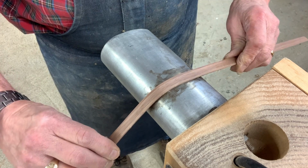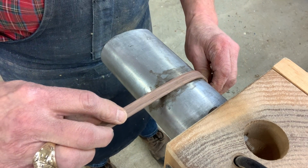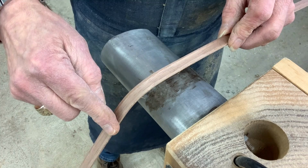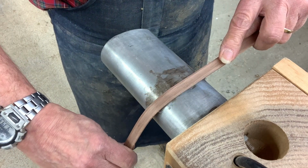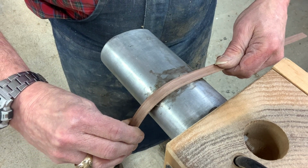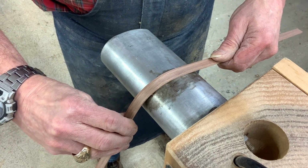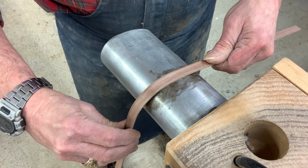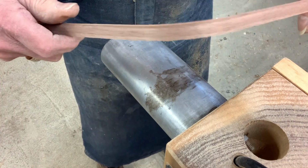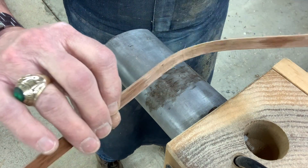And when it does, don't get too jumpy with it, but bend it. Don't waste too much time. And you'll find that the wood will actually bend just off the heater better than it will right on it. To use the heater as a fulcrum to push around doesn't seem to me to work quite as well. So I'm bending now with my right hand over here, and not with my left hand. And I don't try to bend in two directions at once. In other words, don't push with both hands. And you can see that that bends with reasonable impunity.